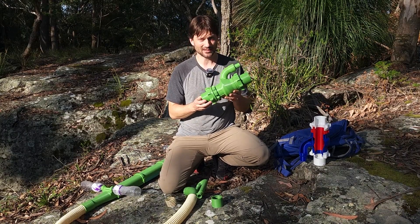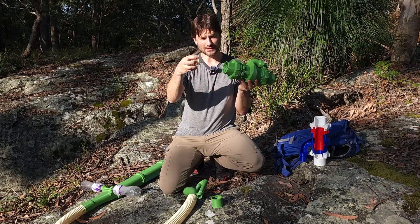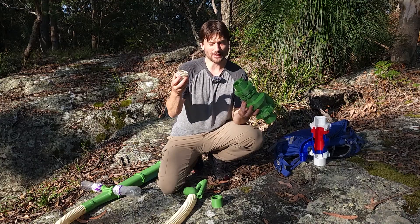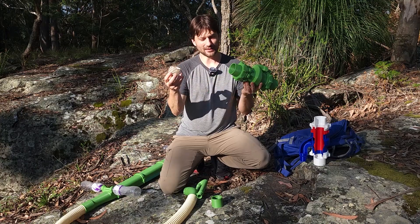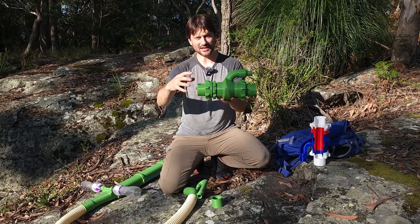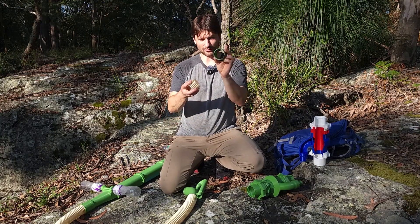This is an oversized jet — the inside diameter of this is the same as the inside diameter of your hose, and the hose actually slips inside these connections on the end. This is a ducting hose for air, a little light duty compared to most dredge hose, something I'm playing around with right now. You just tape around there if it doesn't quite fit, or if you have a slightly thicker hose it should just plug right in. You can glue it or tape it on, and this whole unit threads off the end on both sides, so your hose is kind of like quick-connect to this piece.